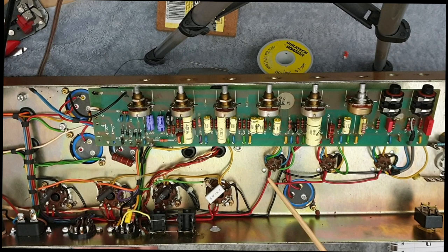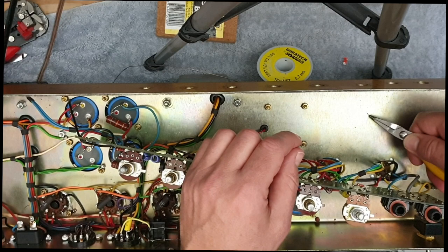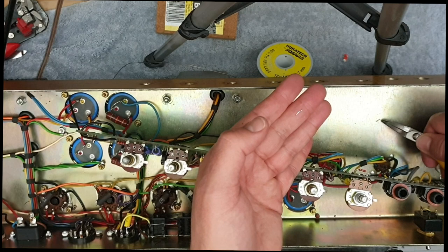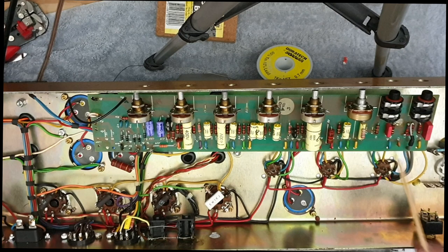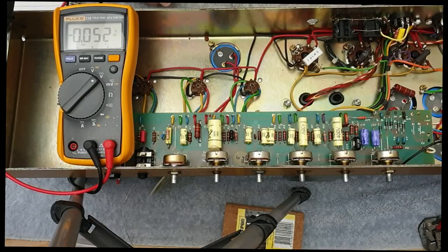On closer inspection, I heard it first - I took the amp in for a quick test and I'm listening thinking, where's the bite? Adjusting the gain pot and it doesn't sound like there's a bright cap. Sure enough, someone's taken it out and just snipped it out. To put the bright cap back in, I've had to clean out the legs that were still in the PCB. I'm going to put a 1 nanofarad ceramic back in here, and I reckon this amp will start to sound like what I'm intending.